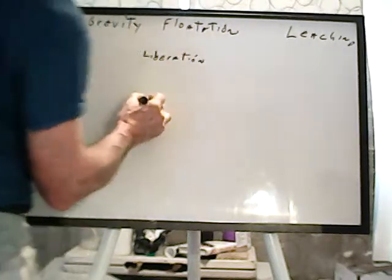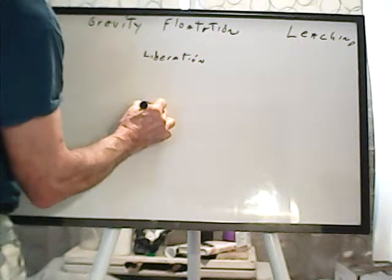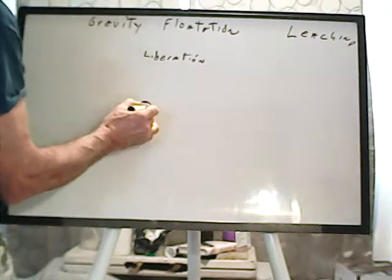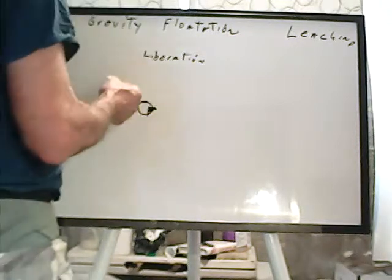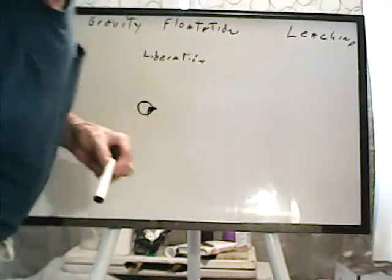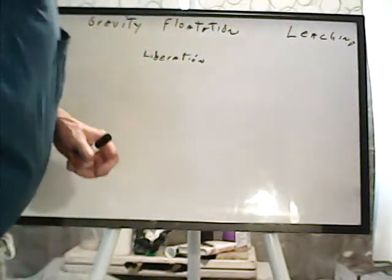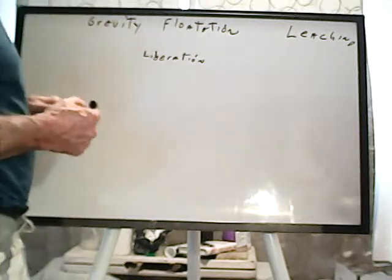So, for example, if you have a little sand particle here that has a chunk of gold on it, you'd have to crush it down to where the size of the particles was somewhere around that generally to get that broken loose. So when you're doing gravity or flotation, you're generally going to be seeking mineral liberation. And when you do that, you're going to have to crush finer by necessity.